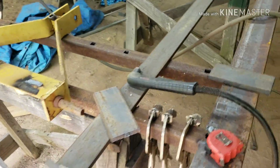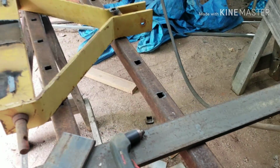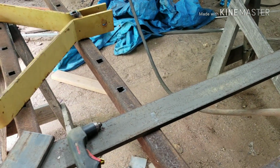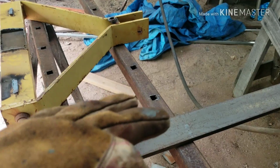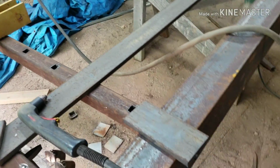but I've got my 2 front racks where I'm going to drop the railroad spikes down in there and weld the tops of them and not weld the bottom. That way if I bend one, break one, whatever, I can grind it off on the top, drop another one in, and weld it on. So I got replaceable teeth.